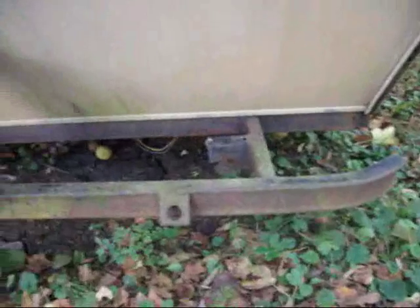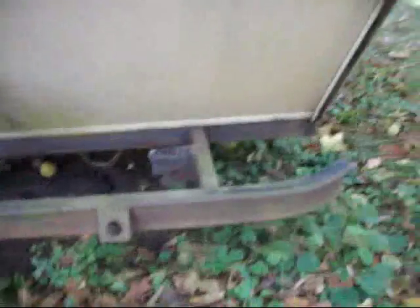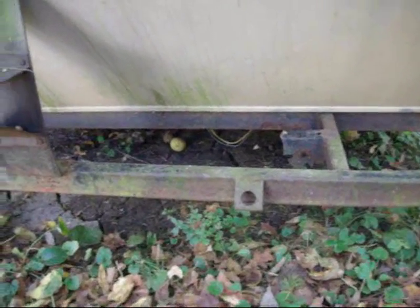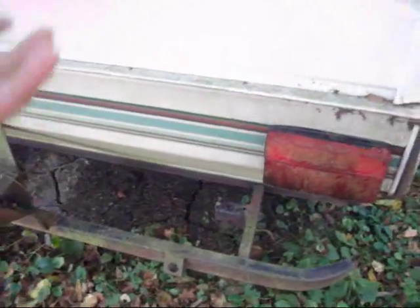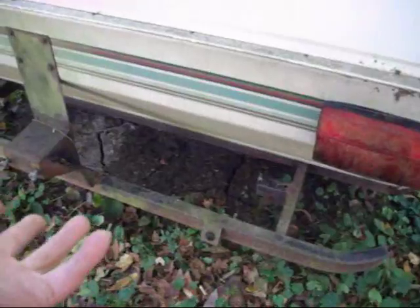Then on the back of it I'll tee it off underneath and come back here. I'm going to set a plate down and mount that little three-and-three-quarter or four horsepower motor that I used in my earlier experiments. I'm going to put a car alternator on it — technically it's not a generator, but when I put a couple of batteries in this camper, I can run the little motor off the gas fire, it'll turn the alternator, and it'll charge up those batteries — like if solar panels aren't running or it's nighttime. So that will keep the batteries charged up — it's kind of like an enclosed system.